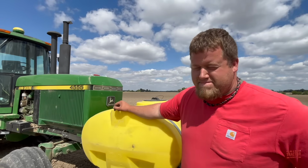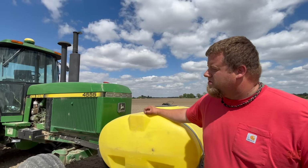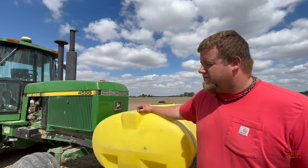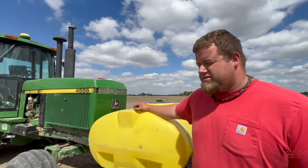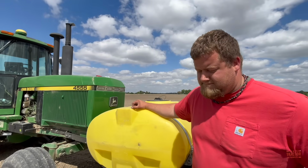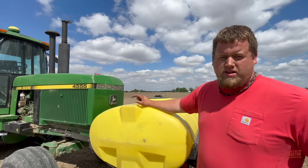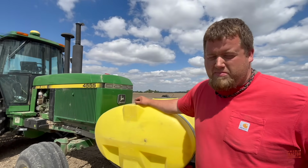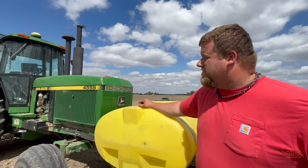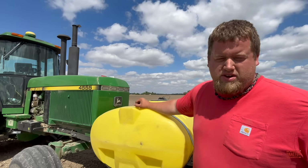And I see with the globe on the roof and not really running the marker arm, so you got it updated for GPS. Yes, I have an Ag Leader 1200 in command, and I'm running a John Deere 3000 globe. It's been very nice, very handy to have. I've had that for about 3 years as well. So you've got a pretty good capacity on your liquid. Each tank on the planter is 70 gallons, and it looks like 175 here on the front. Yeah, 175. I'm running like 5.7 on this, and then I've got it timed out fairly close to where they'll empty at the same time. What can you cover an hour with a 12 row like this? I think it said I was covering 10 acres an hour, something like that. I got to double check, but I was thinking it was around 10 to 12 acres an hour.